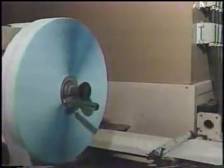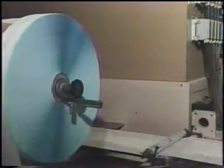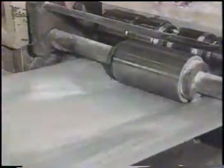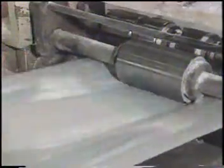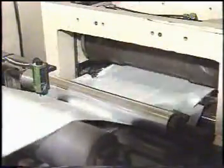This is the adhesive tape machine. The adhesive tape is guided by several anti-adhesive wheels to the door-shaped blade and cut by the converting knife. Then, the vacuum stick is used to reverse the diaper, which has been sucked onto the blade, and half of the adhesive tape is attached onto the PE film, and the other half attached on the inner side of the diaper. The process is also controlled by an electronic monitor. Any diaper without adhesive tape will be separated at the inspection site.